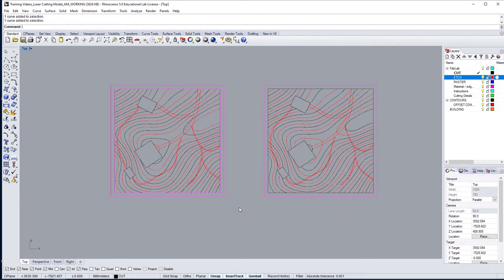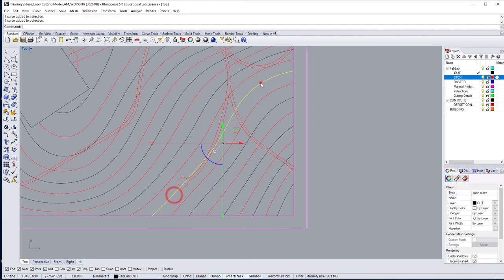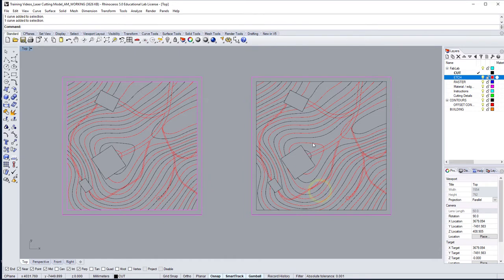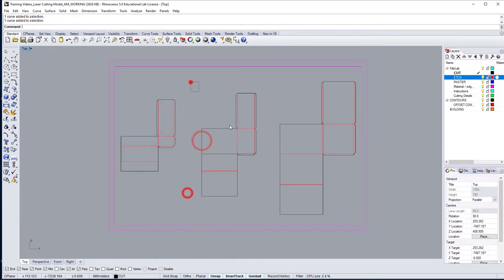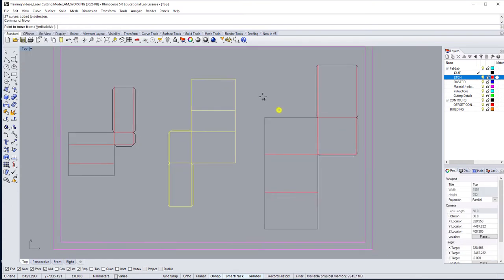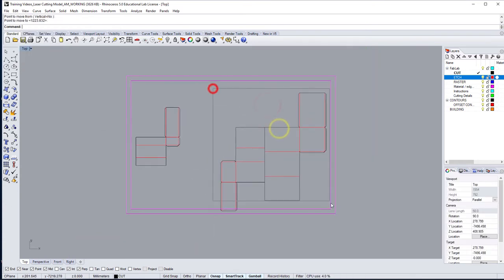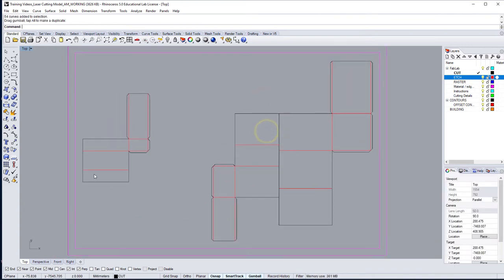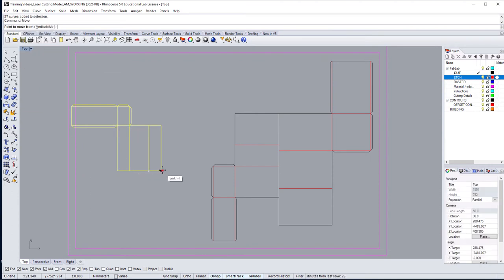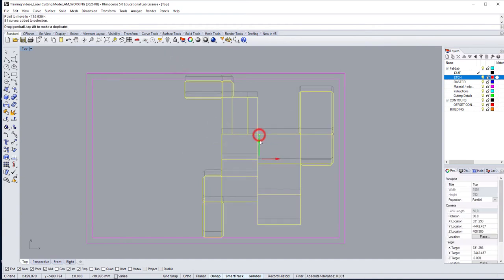This leads us to the second and less obvious tip: how to minimise the processing time of your job. The most common strategy is to share edges of your cut pieces to reduce the amount of cutting required for your job. Wherever possible, identify identical or straight lines of cut pieces to share edges with, and minimise both material waste and cut times. In saying this, it is important to ensure you don't have overlapping and duplicate lines, as the laser cutter will read and cut each one of them, only increasing the amount of cutting time and cost of your job.